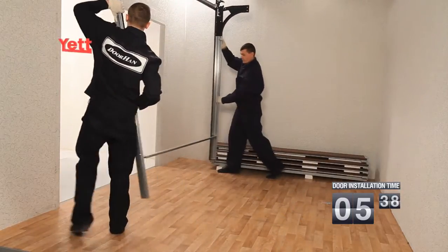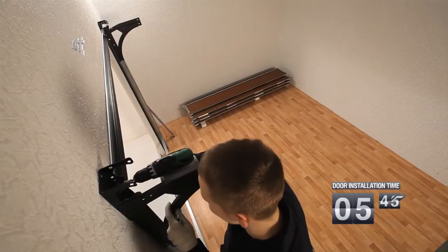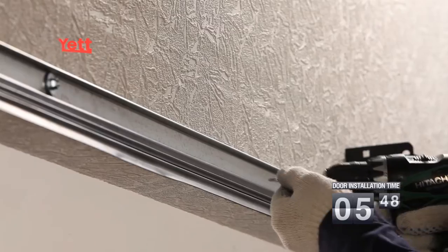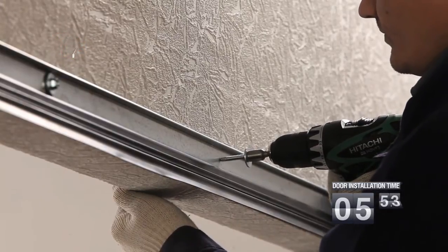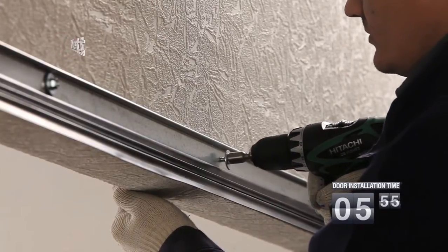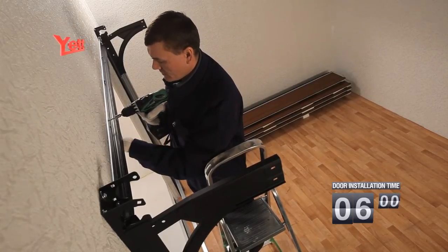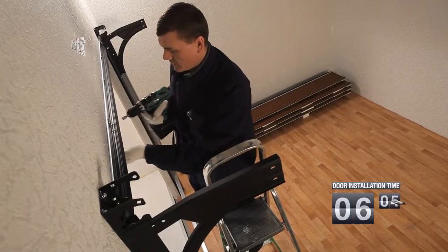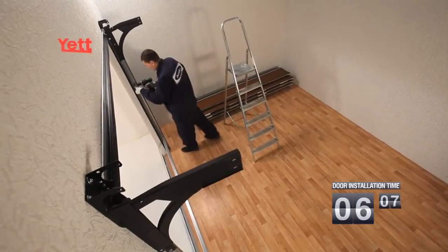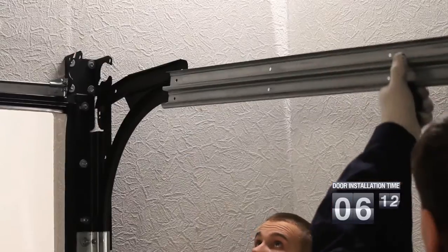When the plain framing is assembled, it is installed on an aperture and preliminary fixed. Depending on an aperture material, we may need to drill holes for fixing the elements. Please note that it is not necessary to completely fix the fixing elements. It is essential that the plain framing can be adjusted to fit the aperture according to the setting out sizes. When the plain framing is fixed, we make a final fixing of an angle post, a band and a crossbar by means of fixing the elements.